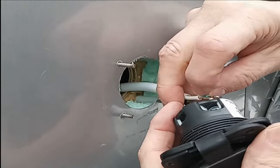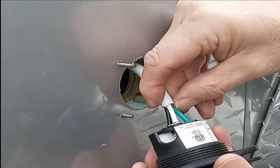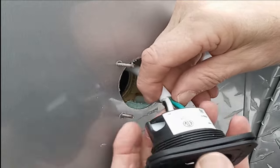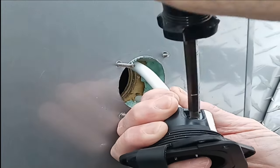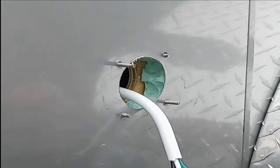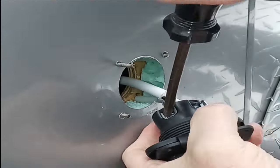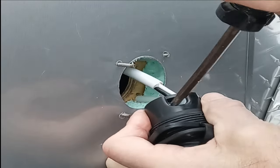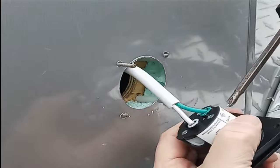The black wire is your 110-volt AC, the white wire is your return wire or neutral, and the green wire is ground. Tighten down each one of the wire connector screws. Be careful not to over-tighten each of the connections — it is a plastic housing and will crack if you over-tighten this area.